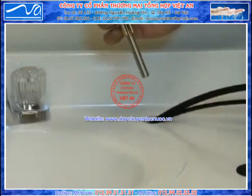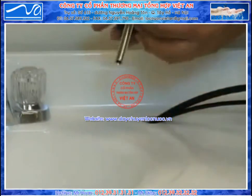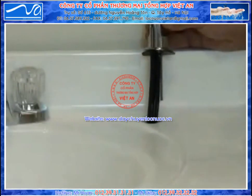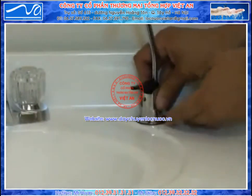Go ahead and slide the faceplate on and then the rubber gasket. We can now attach both of the wastewater lines directly to the faucet via the barbed fittings on the bottom. Once completed, both hoses should be pushed all the way to the top and we can now slide the faucet into place.